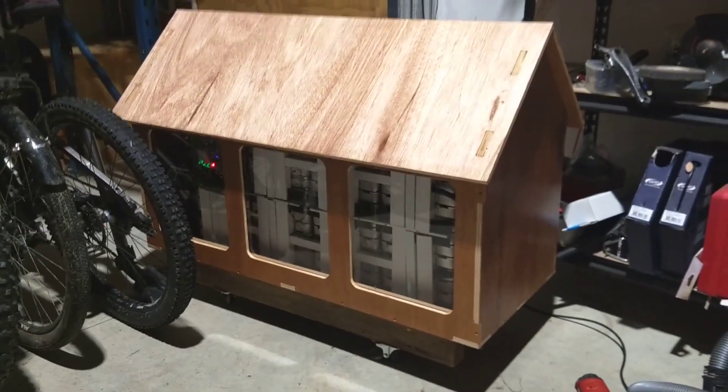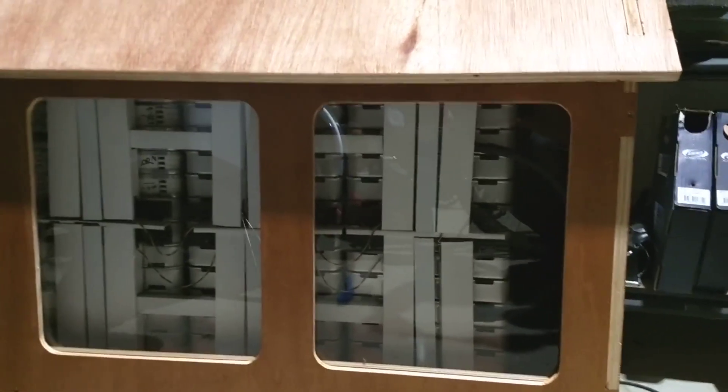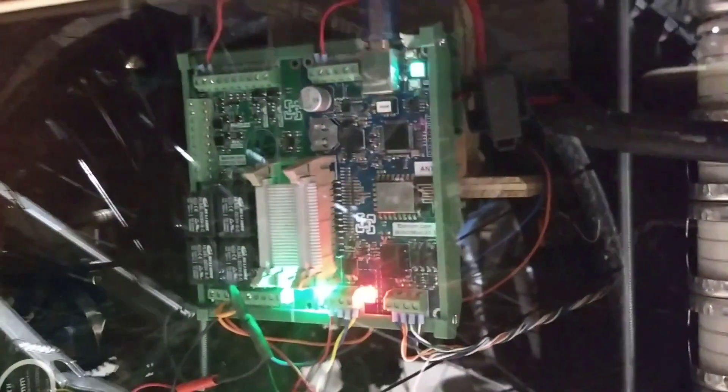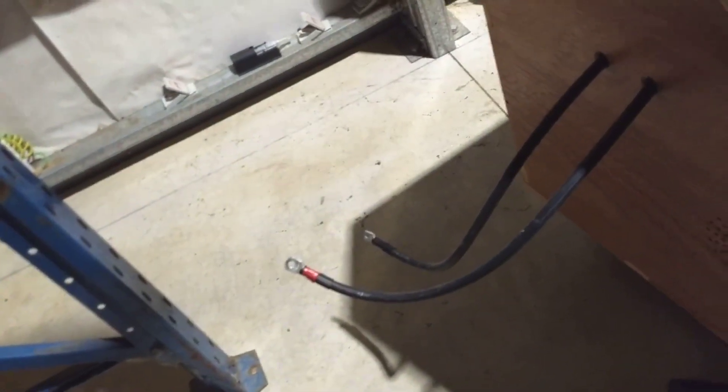It's now considerably later in the evening, but Box-o-matic now contains the battery. We have our 42 Nissan Leaf generation 1 cells all wired up into a normal 48-volt battery bank, and now it has a house. You can see we also have a cooling fan, the battery and BMS computer at the side. Here are the power leads — don't worry, the breaker isn't in so they're not about to short out.